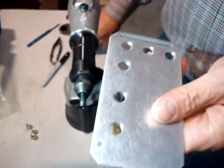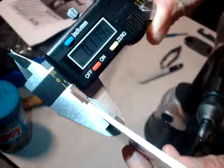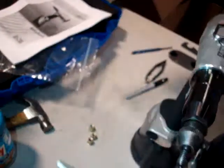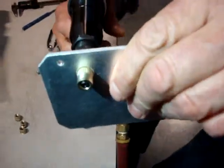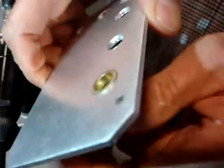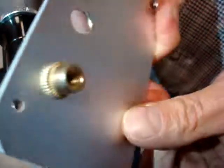Here we have a test plate that is just a little under an eighth of an inch. We'll go ahead and grab another nut, thread it onto the mandrel, and pull the trigger. There we go — looks like a very good installation. The threads are clean and the upset is optimal.